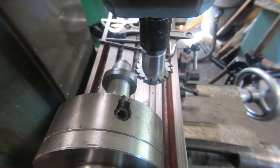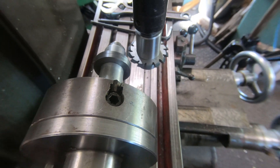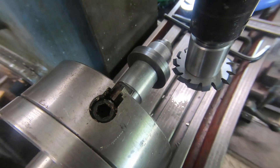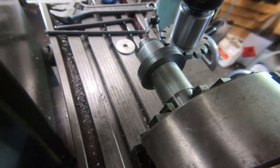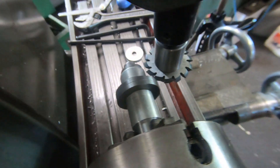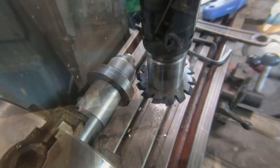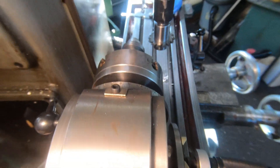Okay, I thought I was okay but looks like I'm going to have to move the dividing head — the table won't go far enough in to set the cutter. I could cut from the other side, but then it's difficult to actually see what the cutter is doing, so I'd rather be on this side. So we'll just set that up — that's the dividing head moved over.